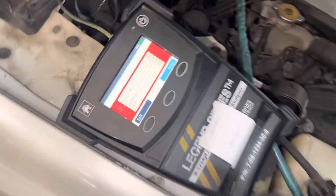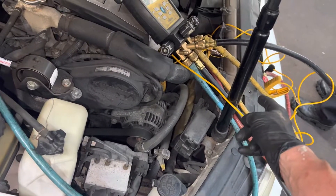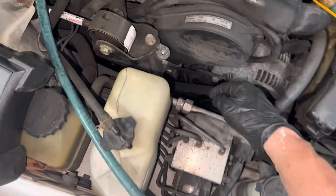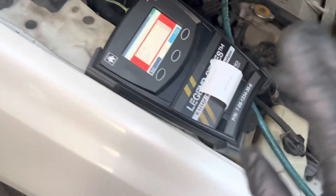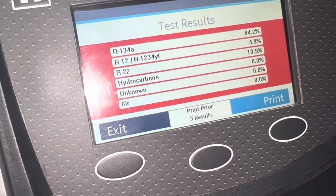This is video two. We got 140 degrees at the discharge of the compressor, 70 degrees at the discharge of the liquid line on the condenser, and roughly 70 degrees at the suction line — but with a suction line of 70 degrees it had 21 PSI. On the PT chart that doesn't jive. They've got some mixed blend refrigerant of who knows what inside here.